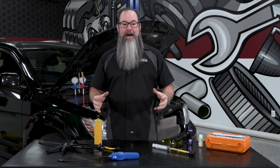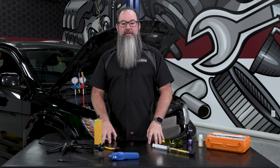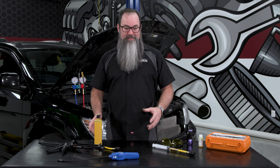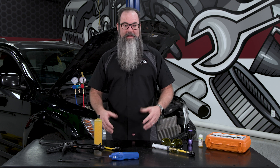I like to inject dye into systems when I work on them or when I'm looking for a leak. There are several different dye kits on the market. Some kits are designed to inject the dye while the system's under vacuum. Some you can inject into the low side of the system while it's running. I personally like to put the dye into the oil on my recovery machine, so when I inject dye into the system after my evacuation process, it's getting dye put into it right there. Essentially every system I work on gets dye in it.